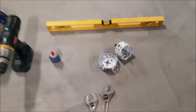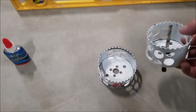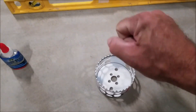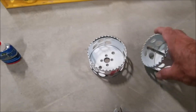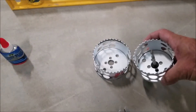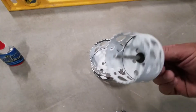You're going to need some hole saws to cut through the wall. Most of these mini splits are going to say like two and a half inches hole saw. I like to do three inches — that way I don't have to fight the line set going through the wall. That's just a personal choice. I just caulk it real good all the way around when I'm done. But look at your instructions — it's probably going to be a two and a half inch hole saw.